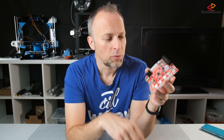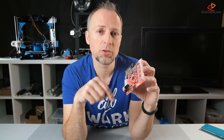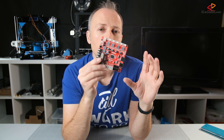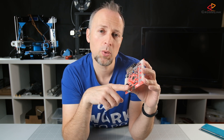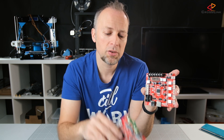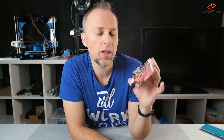So why would you buy this board? Because of the safety upgrades — the fuse, the new connectors, and the possible 24-volt upgrade — it's definitely worth getting if you need to replace your old one because it failed or burned through. I'd definitely look for this new version rather than an old one. Also, as shown in the last video, it's already ready to flash new firmware via USB cable. However, if you already have a 1.5 board and are thinking of upgrading, you might consider going directly to a RAMPS or MKS board, since this is more of a safety upgrade than a feature upgrade.